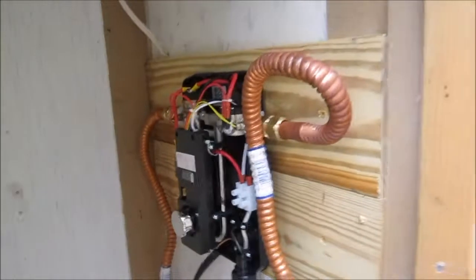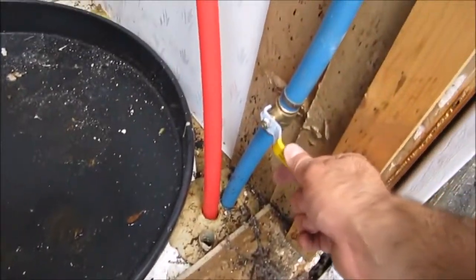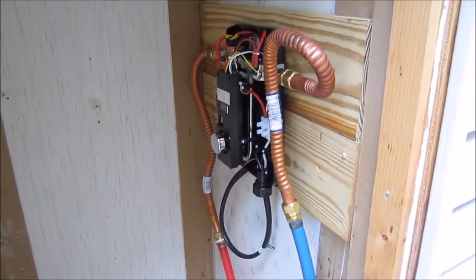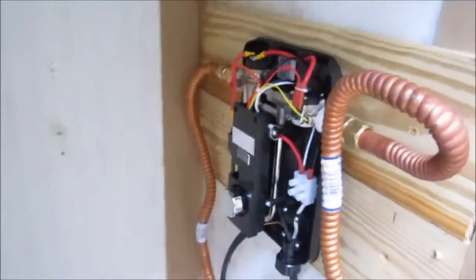The water's on — we had to turn it on under the house as well. It's flowing into the kitchen. I turned it back on, then I'm going to go turn off the hot water in the kitchen and energize the unit. It looks like we might get some rain. The hoses are charged and the air has been bled out of the lines. I'm going to clean up the pipe dope and we're going to sit for 20 minutes and monitor for any leaks — typically the first leak shows up in the first 20 minutes.